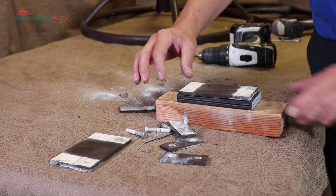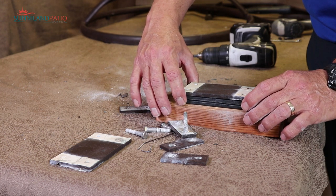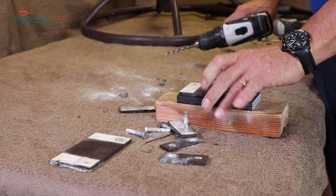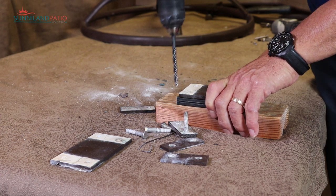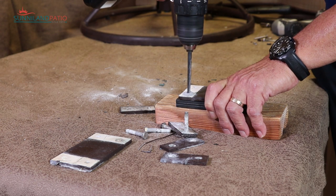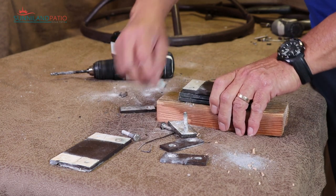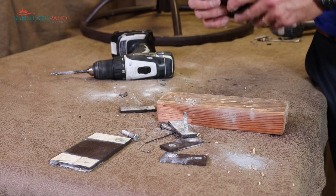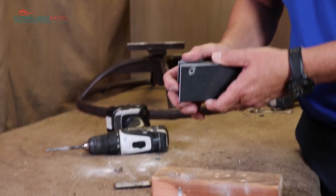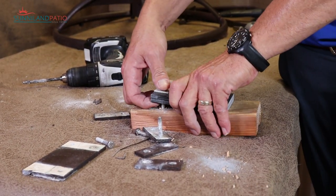This plate here seems to be just a hair shorter, so we're still going to use the two-and-a-half inch by five inch plate because that's the closest. I'll just leave a little space on either end to center the plate. Then, giving good downward pressure and keeping the plates very straight together, we're just going to drill our holes into the new one. You see how the wood caught that — just tap that off. A good idea is to put one of your bolts through these holes so they're staying straight when you go to finish the job.